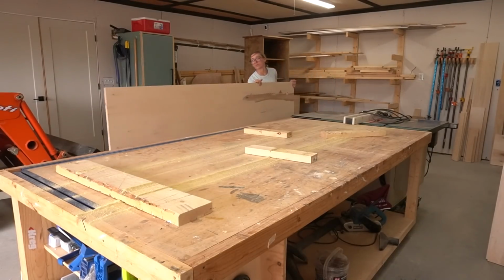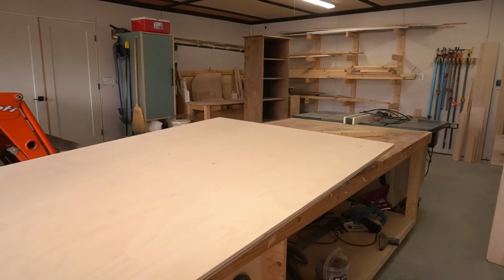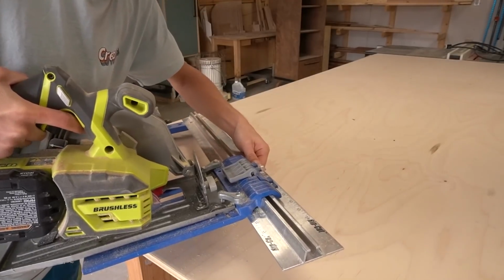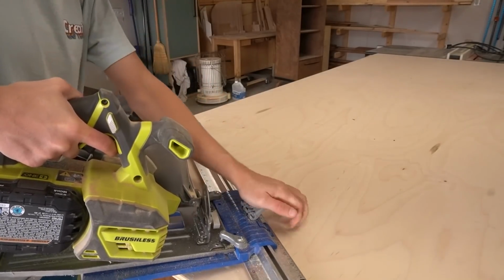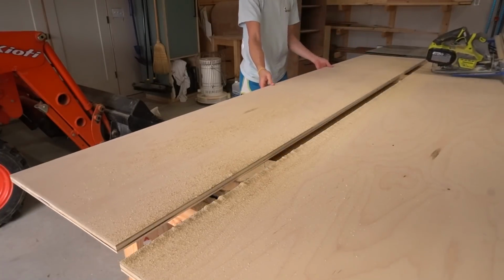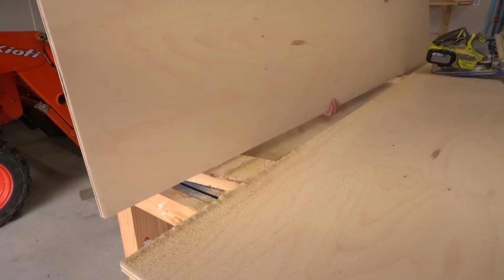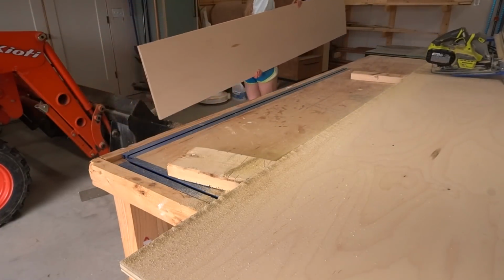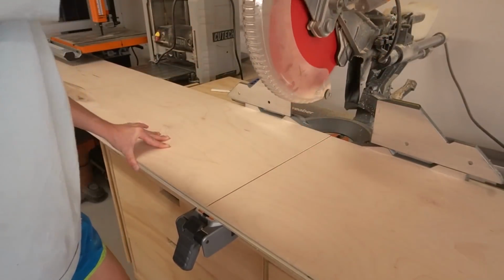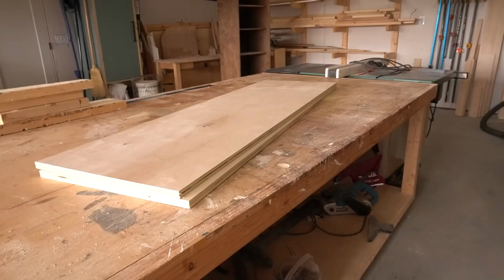From these 2 strips, I cut a top and a bottom, plus 2 sides for the dresser cabinet. Now, just like the last dresser and the nightstands, I wanted the inside of the dresser to be 1 inch inset from the front edge of the main cabinet. This is purely for design, and I just like the extra dimension that it added. So I ripped 2 strips from the second plywood sheet to 17 inches wide and used these to cut the 2 divider panels. I set the rest of these strips to the side to use later.